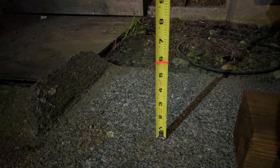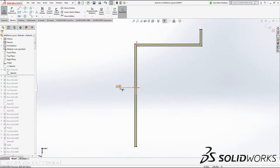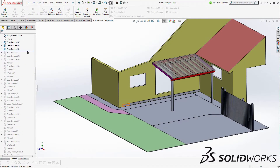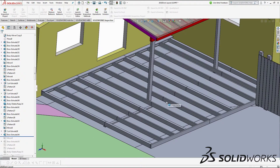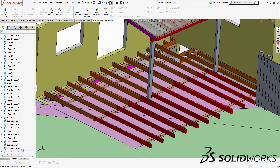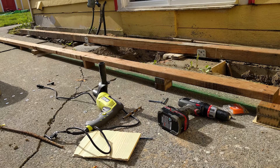First, I measured the space and also recorded the different elevations with a laser level. With this information, I was ready to start the rough sketching of the 3D CAD model. Typically I would suggest modeling up all the parts and then putting them into an assembly, but in this case I didn't even know what my design was going to end up being. So I started just sketching within a single part, and since SOLIDWORKS allows for segmented bodies within a part, it essentially acts like an assembly anyways, which really helped. I went through several different foundation designs and weighed the pros and cons of each, taking into consideration form versus function versus cost, and landed on the sleeper board design, which is basically bolting pressure-treated lumber to the concrete slab and using it as the foundation.